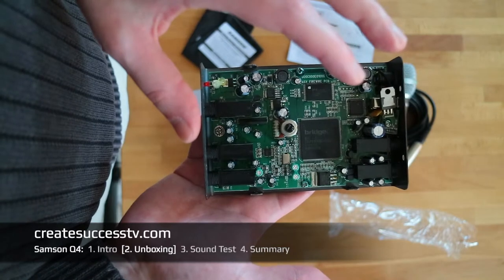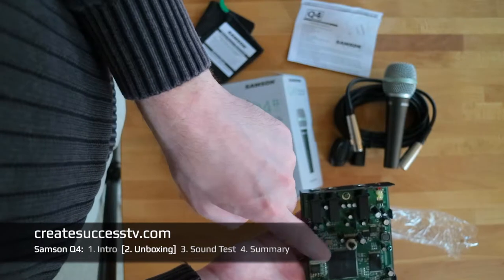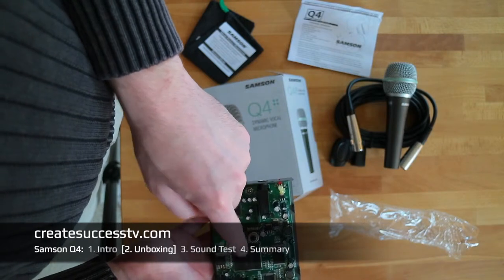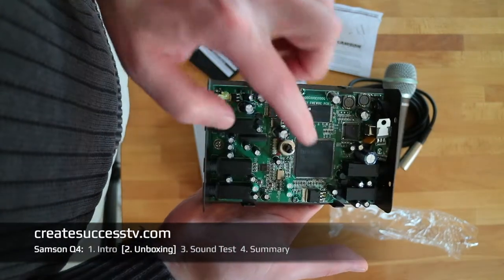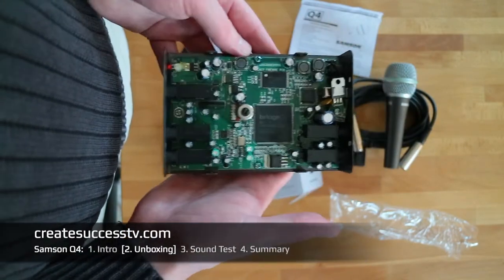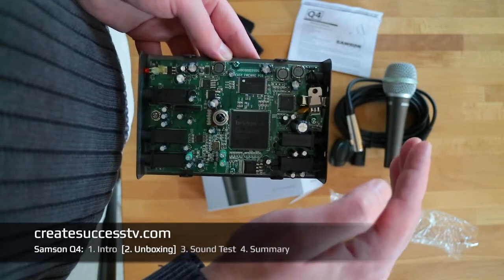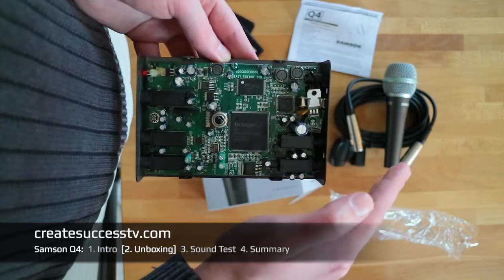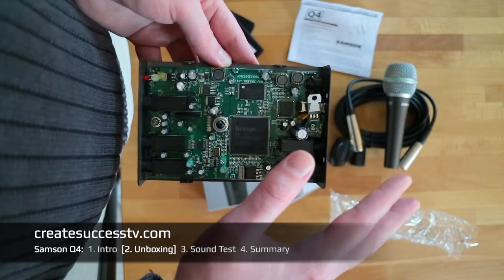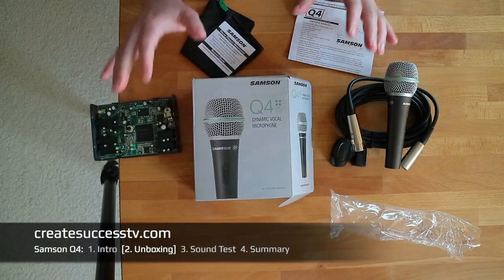For example, my firewire audio interface has a lot of space to put a big chip for analog-to-digital conversion. Even a cheap audio interface has more room for quality components than a USB mic. An expensive interface will have a higher-quality converter, and it's not just the converter — the other components on the board matter too. So yes, a USB mic is really easy for beginners, but ultimately XLR is superior because it's way more flexible and you can mix and match different components.